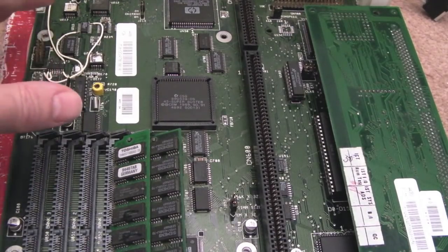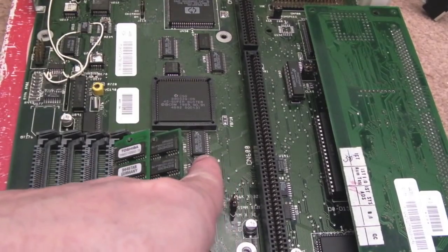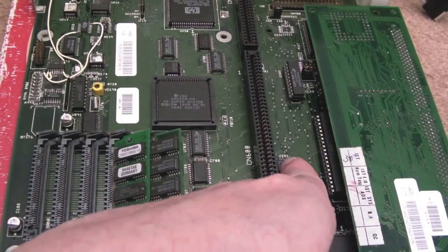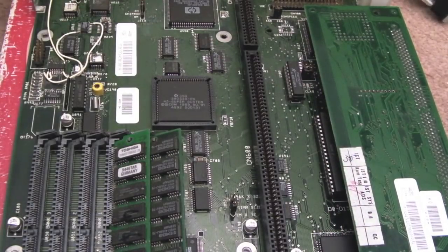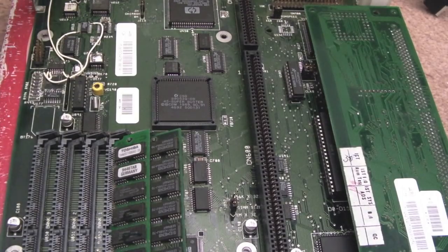Maybe what I should start to do now is resolder what I can resolder. That chip there that I cleaned up needs reflowing. I could start to bung some of these wires here. What I mean by that is clean on both sides first of all, and then get a piece of Kynar through. Make sure that the surface is scratched around the via so that I can solder on both sides, and literally fill the via with Kynar and solder. And just do it cleanly so that you've not got big wires stuck out here. It'll just be a little solder blob.